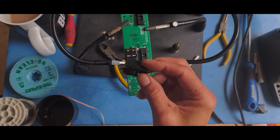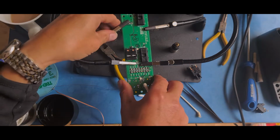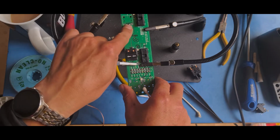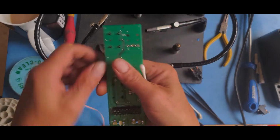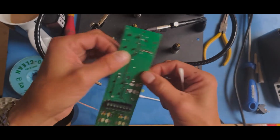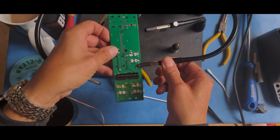So this is like part 3 because my phone battery completely died. I have cleaned the board. I've filled in the two vias underneath this, and also put a tiny little bit of solder on there just to tin this side of the pins, because when we solder on the other side, I'd rather the pins went through and the solder melted on the other side, went all the way through and completely connected these two vias. Cleaned the board up as much as I can on this side. I haven't done this side yet, so I'll give this a quick clean.